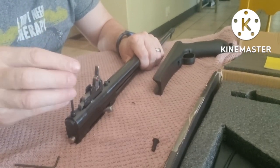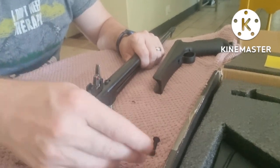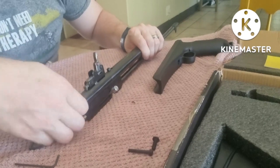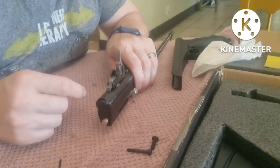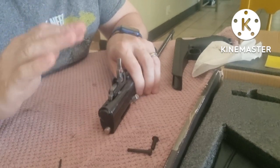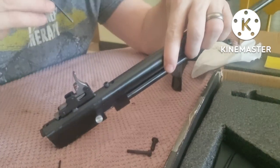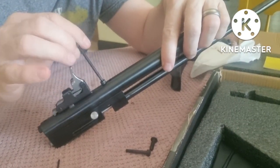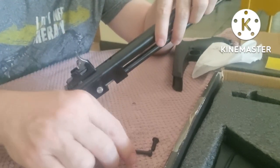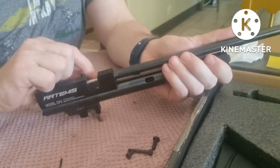Let's loosen this up. Take out the back cap screw and that gives us access to the cap over here. This cap seems pretty tight. If your cap screw does not want to come loose easily, don't panic — I'm going to show you another way to remove it. Next, let's loosen this cap screw that's holding the CO2 valve in place and take that out.